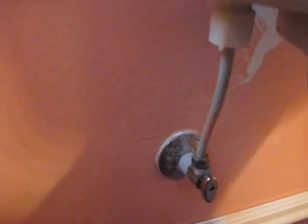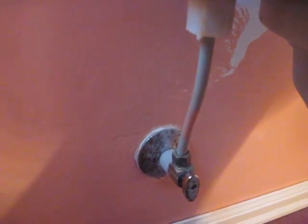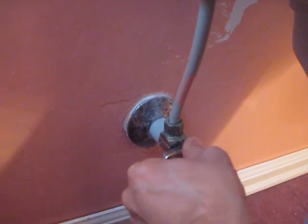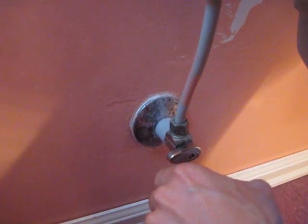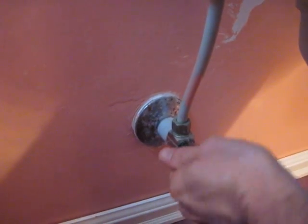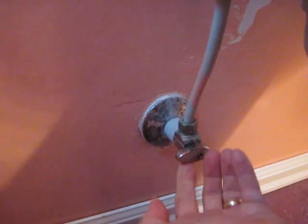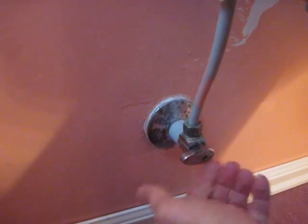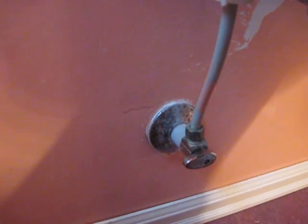So the first step is just to come down behind the toilet, either on the left or right, is the water shutoff valve. You want to typically turn these off by turning it clockwise. So this would be on, this would be off. Many of these you're actually having to screw them quite a lot. So this one's just a quarter turn and it's off.